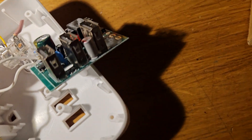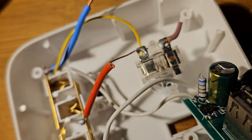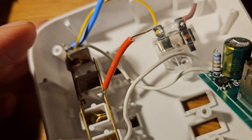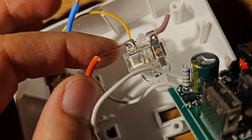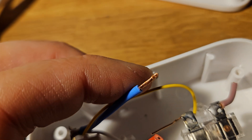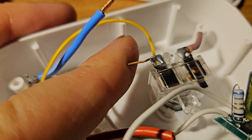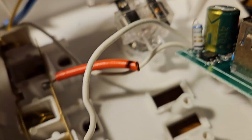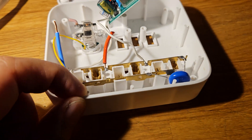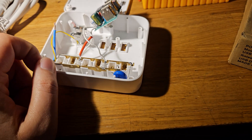The one really sketchy thing though is this wire, which I have cut, that goes between the power switch and one of the live and neutral plugs — I assume this cuts the live, one would hope — for the outlets. Everything else in here is about 16 AWG, which can carry 10 to 12 amps, fitting the 10 amps advertised. But if you look at the size of this, it's only about 0.6 or 0.7 millimeters in diameter. This can carry only 3 amps.